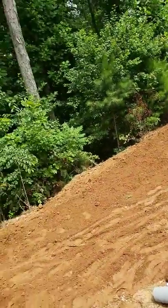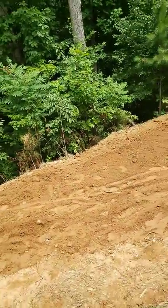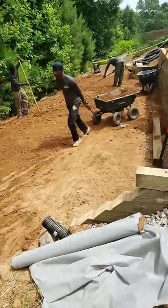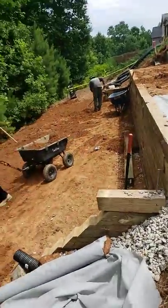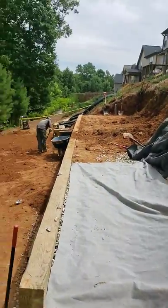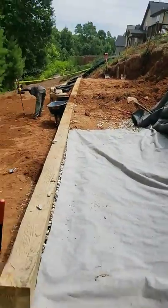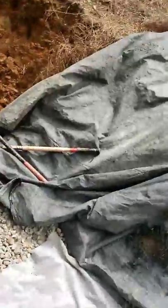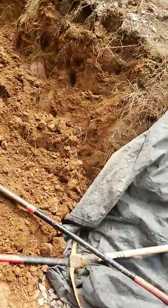As you can see, this landscape looked like this before we got started, and we've been able to turn it into an outdoor oasis with this magnificent transformation. We're getting ready to put in our Zeon Zoysia sod, which is going to make this outdoor landscape even more unique. Right now, this timber retaining wall has been backfilled with 57 gravel, and we've also put in a felt fabric that keeps the gravel from going down to bare dirt.